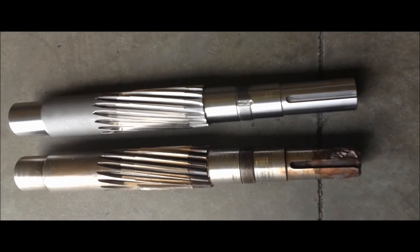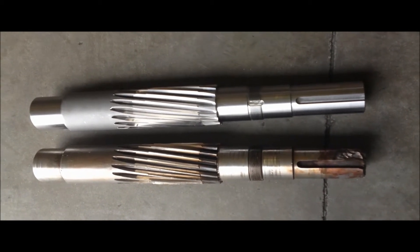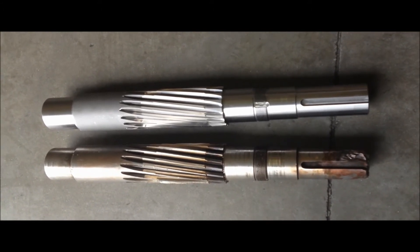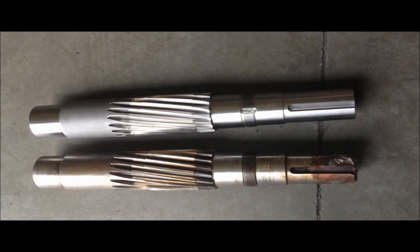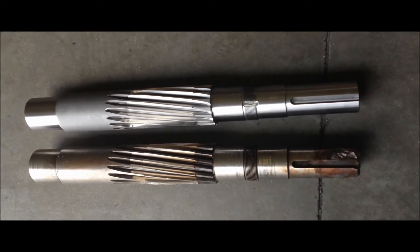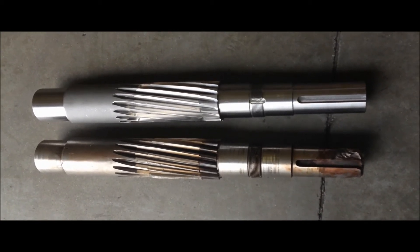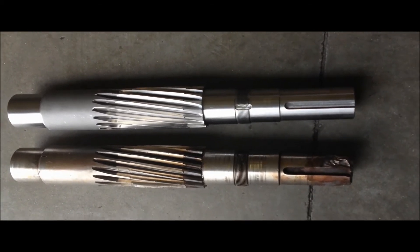Here you go Tim, we completely finished the gear shaft and we are getting ready to package everything up. This is the helical gear shaft, 8620 carburized heat treated, ground finish, and this is a rush repair order for our customers. This video is just testifying and displaying the work that we've done — came out real nice.